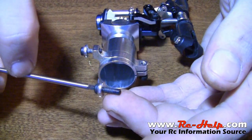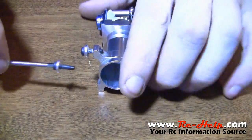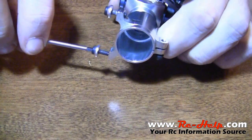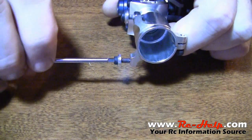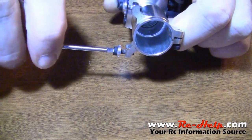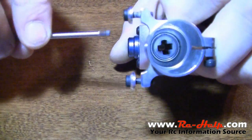What I'll do is take it and run it on my finger to get all that excess off. Once you start threading this in, it's going to keep all that excess from squeezing out, especially in your feathering shaft where you have your bearings — you don't want that stuff squeezing out. Put it on the tip only, so as you keep going in, it'll spread throughout the threads and lock it in place.